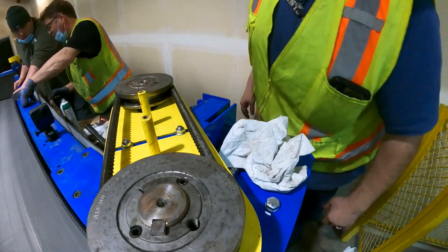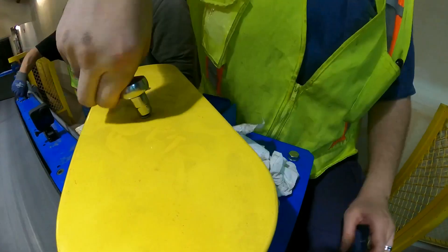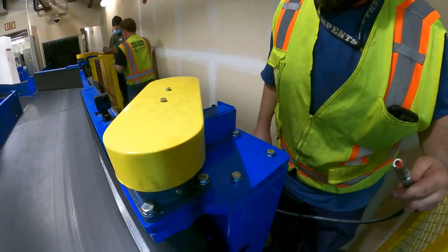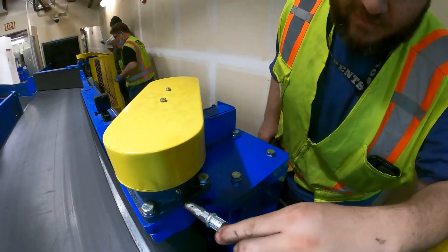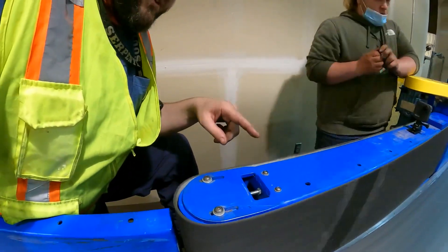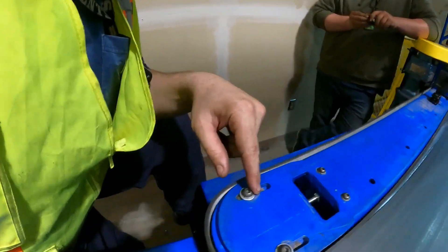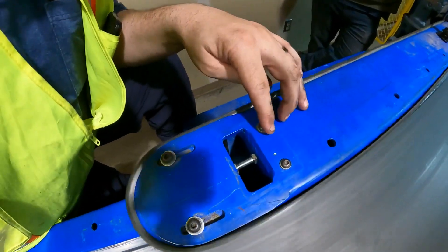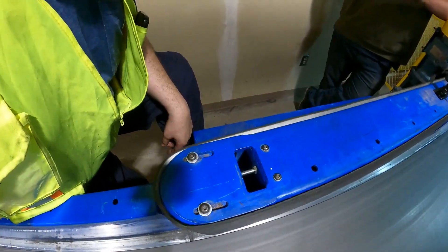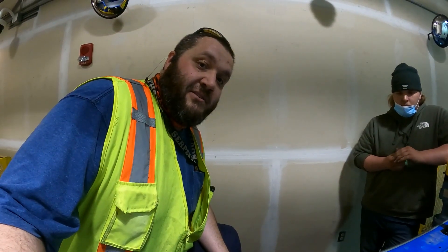Let's go ahead and get the safety cover back on the belt. We'll go ahead and service the unit too — give it just a little bit of grease while we're at it. The only part you really didn't see is when you get done you've got to adjust the belt. If the belt's riding too high or too low, loosen up the front drum roller with these two screws. The adjustment is performed right in there — this bolt adjusts the drum back and forth, allowing you to have the belt ride either higher or lower. That's all for this training video, thanks for watching.